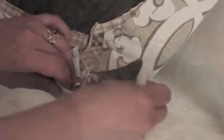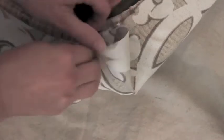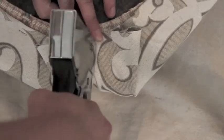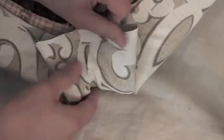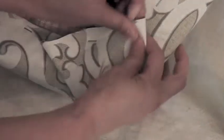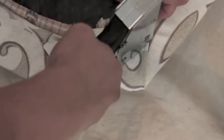The back of the chair has an L-shaped cutout. To upholster this, push the seam in the center and pull it real tight and put a staple in the middle. Then individually pull each side out to the side to make it really fit tight around that corner.